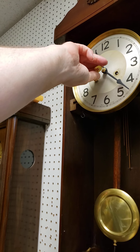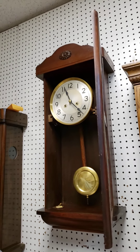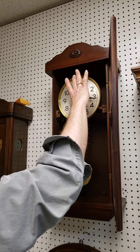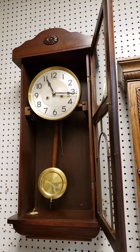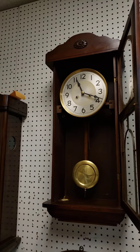Wind it up until it comes to an absolute stop — again, no such thing as over-winding it. Once the clock is fully wound, set it to the right time. Make sure you have an accurate timekeeper with you when setting it up. With this clock you can turn the hands backwards inside of the half hours — inside the six and the twelve. If it's a few minutes fast you can back it up, and if the clock is slow you can run it ahead a couple of minutes.